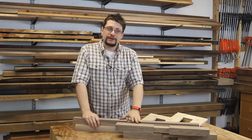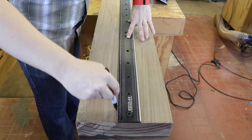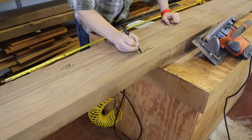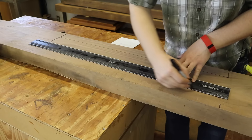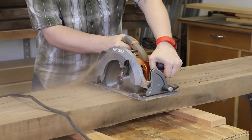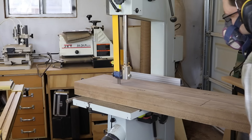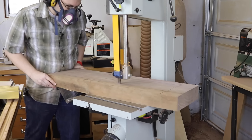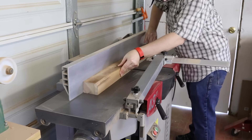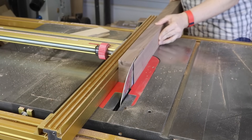So what I've been working on is breaking down parts. The first thing I did was take out my piece of 12-quarter walnut and I marked out where I wanted all of my parts — the trestle, the feet, and the table supports at the top of the leg. Once I had all those marked out, it was time to break everything down. At the bandsaw I broke that board down to its smaller parts and let everything sit for a couple of days. Then I came back, started milling everything up, let that sit for a couple more days, did a final milling, and got them to the correct thickness, width, and length.